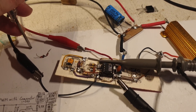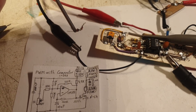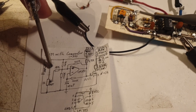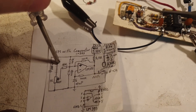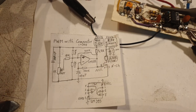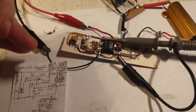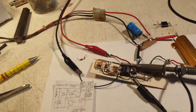I kind of solved that 20% mystery. The lowest duty cycle was 20% before, and now it's 10% with this little modification — removing the two diodes and replacing them with a yellow wire. Those diodes were biasing the original circuit to 20% for some reason. The American guy who gave me this circuit probably didn't know about it, or forgot. Well, I solved his problem.